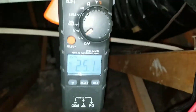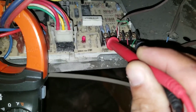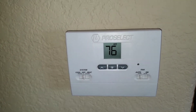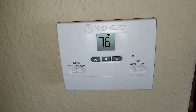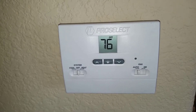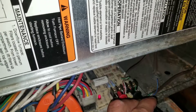Because my blower motor is running, you see I have 25 volts, and I have my lead on my common and on my G terminal at my furnace board. Now I'm going to turn my thermostat to the off setting. You may hear your blower motor continuously running because you may have a delay on your system — just wait for that to shut off. Once we go back into our attic and test the furnace board, we shouldn't have any voltage between our common and our Y terminal. Our blower motor turned off, our condensing unit is off. I have my leads on my common and on my Y terminal, and you can see I have no volts.